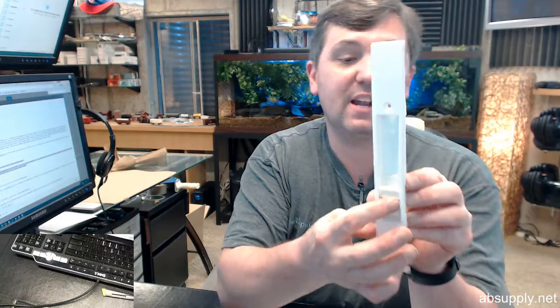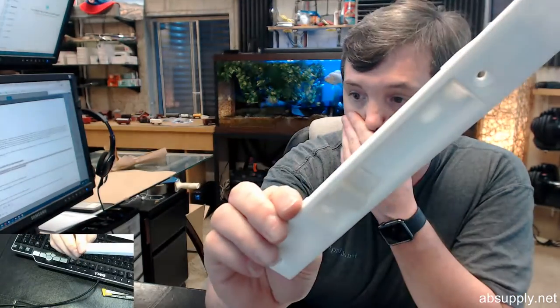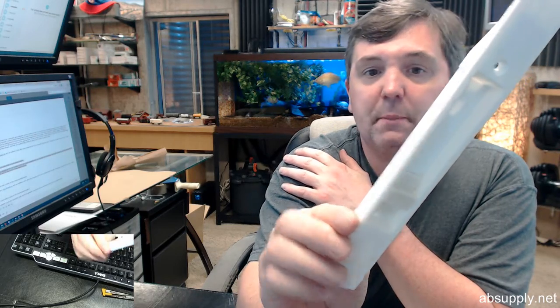The part number for the lock, the MS-1849, is there. The exterior escutcheon is called out if you've got the 4431 series lock, which would have a key cylinder. Now, the interior escutcheon on the right side, the 41-0397-XX is on the template. The XX means 01, 02, or 06, and you have to decide which it is. Also, not uncommon to sell just that knob as well, that 25-0077 knob. Okay? Very common.